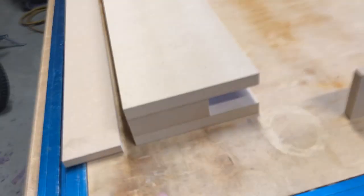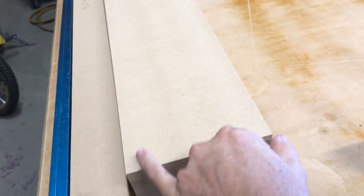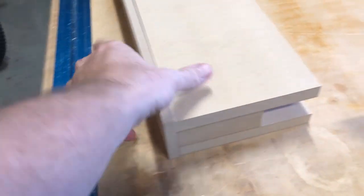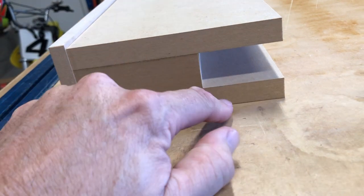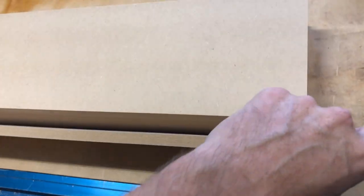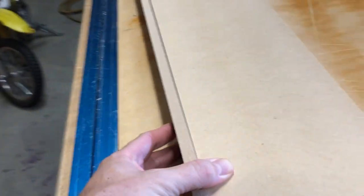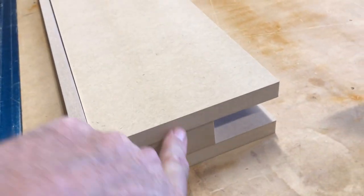So right now I'm doing this laminated approach, and this is going to yield me about 6.5 inches wide once I put this front on. This is 3/4 inch and 3/16, that total distance. These pieces, if you see right there, are 2 11/16 rips, and you can see they're a little bit big, about 1/8 of an inch. So about 2 9/16 thickness for the total thickness here.